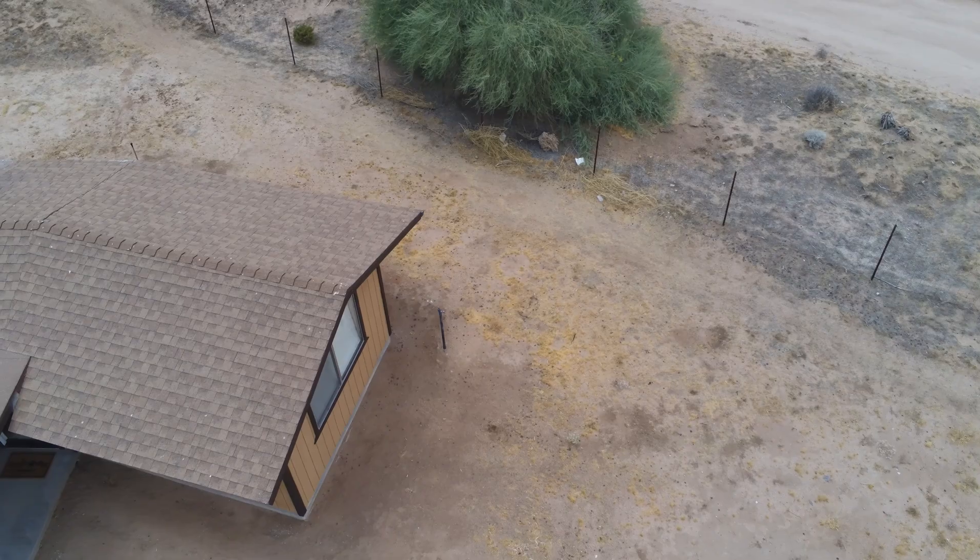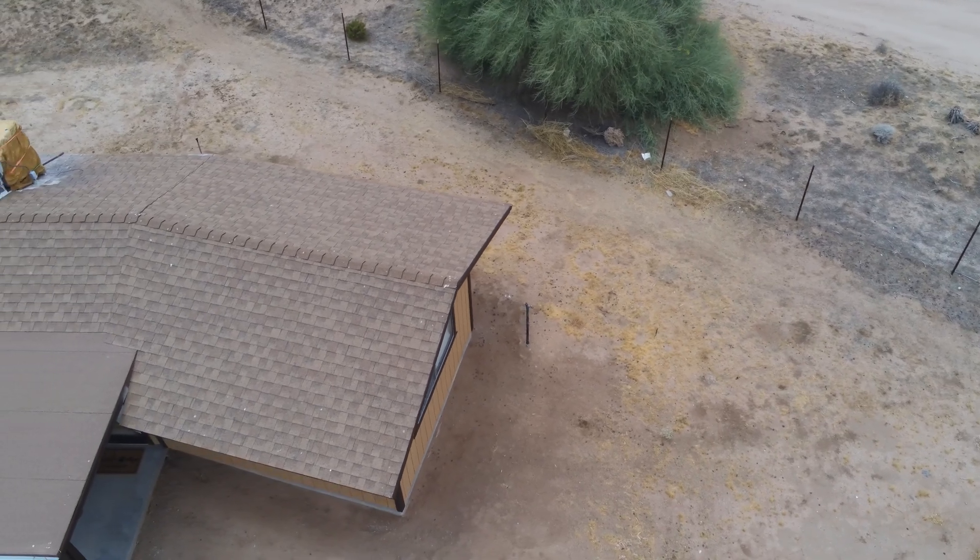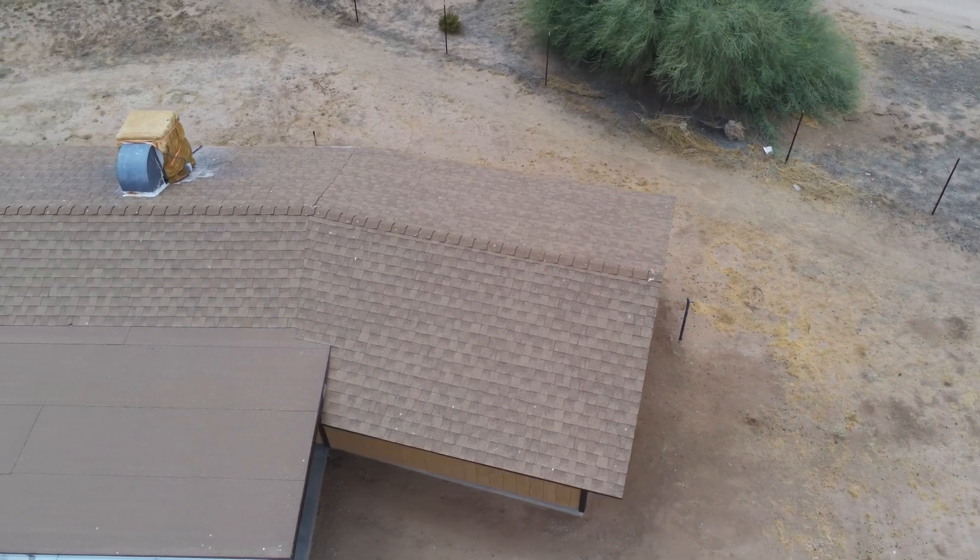When using the standard RGB camera on your drone, you'll want to capture footage when enough light is available to see the wear and tear on the roof. Generally, the best time for conducting thermal roof inspections is 45 minutes to an hour after sunset. During the heat of the day, as the sun makes the roof universally warm, this can mask some flaws or areas of concern. After sunset, the roof will rapidly cool, and about 45 minutes to an hour later, problem spots will really stand out thermally. Remember, you'll need anti-collision lights for your drone if you're flying during this time of day.